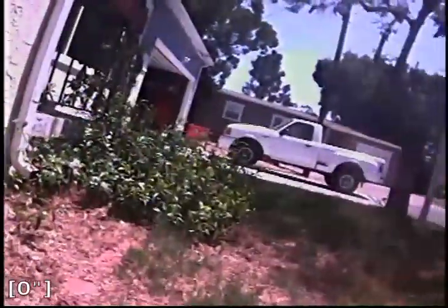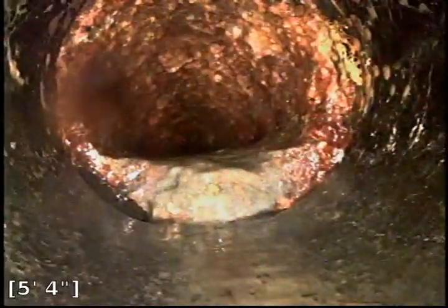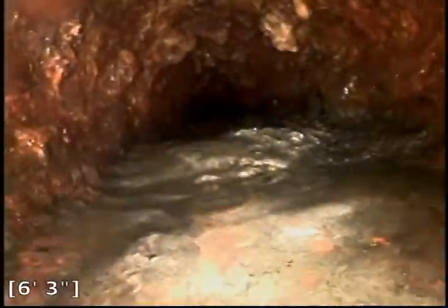We've now moved to the front of the house. Here we have two cleanouts that were installed farther away from the house — one sweeps towards the house, they crisscross each other. Going down this one first — it's a very shallow pipe. There's the other t-junction right there; you can actually see sunlight coming through. This section is plastic, and then immediately it goes back to cast iron. Cast iron always has a lot of scale or buildup deposits, so you can see we go from a perfectly open inside diameter in plastic to a little buildup on the cast iron — that's normal.